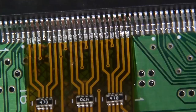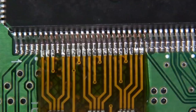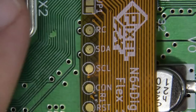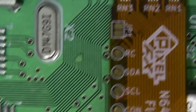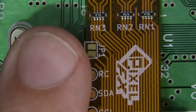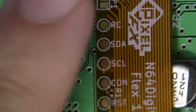We're all finished with this specific flex cable. I apologize if that shot was a little bloomed out. Always inspect your work — make sure you have nice clean beautiful fillets, which we do here. Now we are almost finished with this flex cable. You'll notice we have a few solder pads here that we have to manually solder to. I really don't like this — I wish there was a secondary flex cable that came over here to the PIF chip — but ultimately we have to break these out manually. There are just a few here, and also this JP1 jumper is for the clock mod. This is typically used for PAL systems so that the N64 Digital can generate the clock signal to alternate between PAL and NTSC frequencies. We don't care about that so we're going to leave it alone.